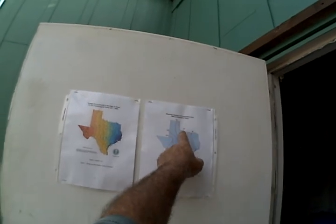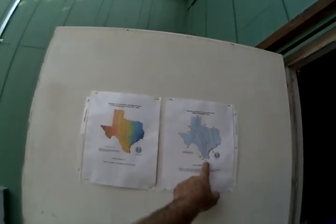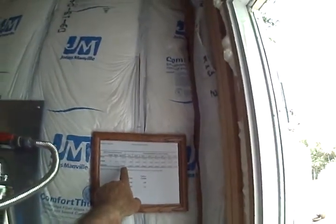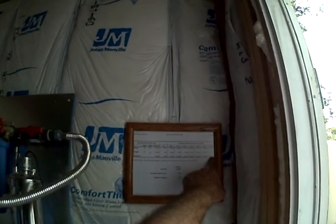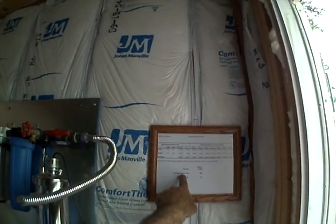As you can see on this chart, this is about the amount of rainfall we usually get in this area — the average number of days without rainfall is about 60 days. We live in an area that gets between 32 and 36 inches of rain a year. Our rainwater collection system covers both the house and garage; together, one inch of rain gives us 1,700 gallons. At about 30 inches a year, we're going to get about 52,000 gallons over the course of a year. Our usage rate is 10,000 gallons per 100 days, or an average daily use of 100 gallons, giving us about a three-and-a-half month buffer supply.